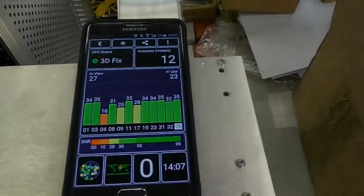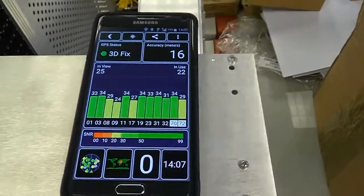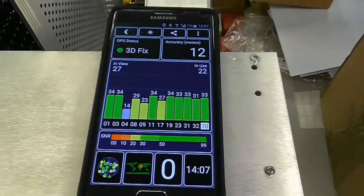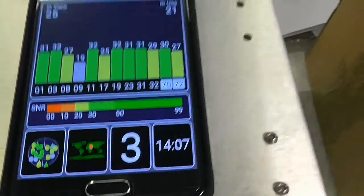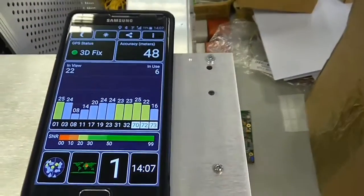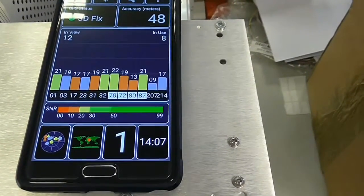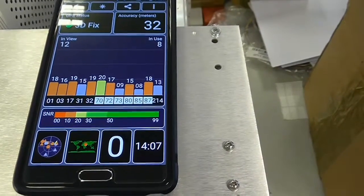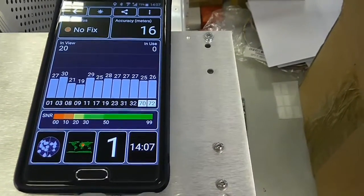In addition, remember the system also transfers GPS and GLONASS signals. Here we are doing a very simple test that you can do with any standard smartphone with any GPS satellite finder app. With the indoor unit powered up, we got great reception on our GPS. During the same test, we disconnect the indoor unit and we see a drop in the signal. Turning it back on, we see the signals return.